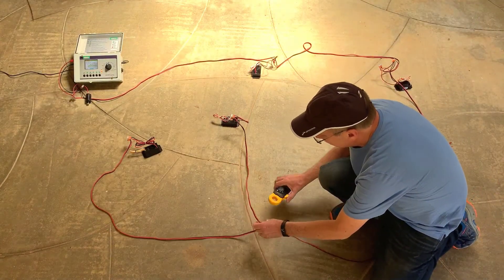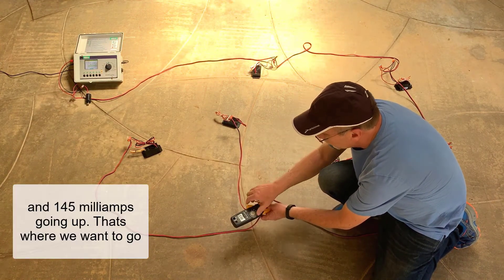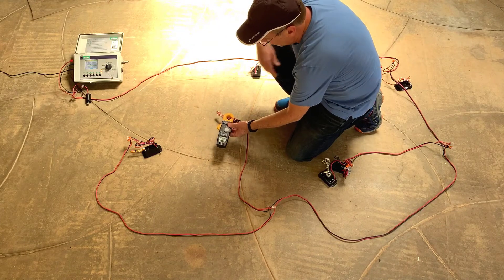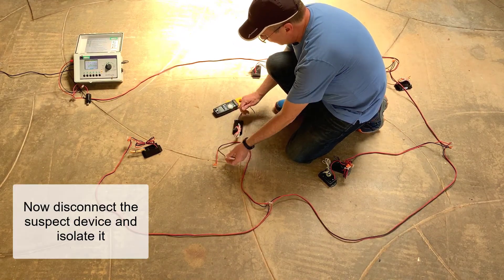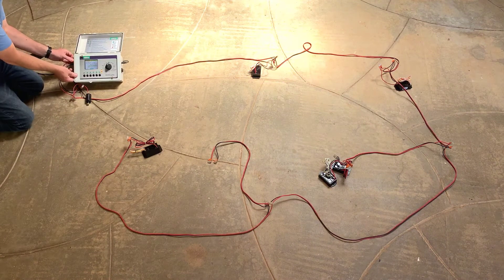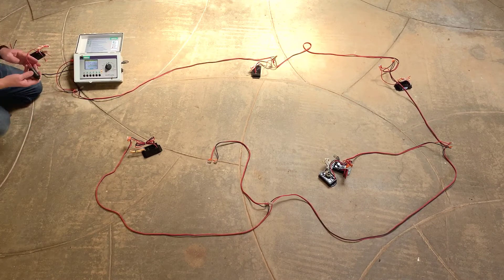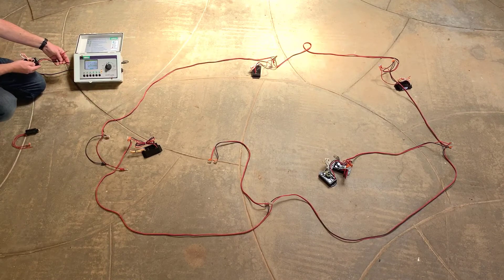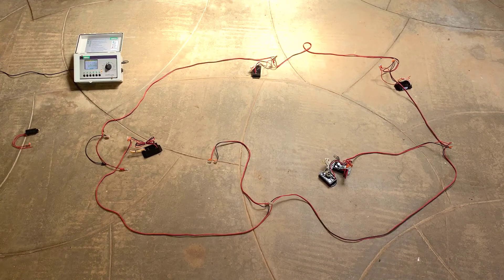At the next three-way splice, I'm measuring 145 milliamps in, 0 milliamps out to the left, and 145 milliamps going up — that's where I want to go next. Checking the splice of the device shows the bicoder is drawing 145 milliamps. That looks like a problem. The next step is to disconnect the suspect device from the wire and isolate it. At the controller, I'll remove the solenoid and restore the wire path. The two-wire overcurrent message does not reappear when the bad device is not connected. As a final test, I disconnect all of the wire path and connect only the device to the controller. With only the bad bicoder connected and no other wire, I can be 100% certain this specific bicoder is the issue.